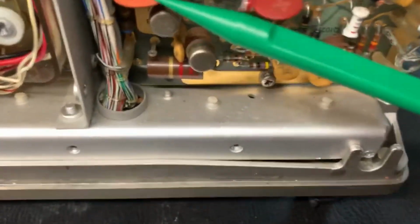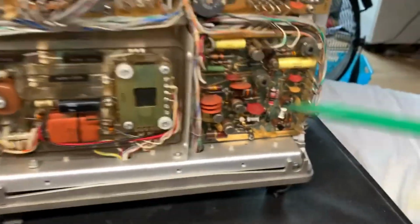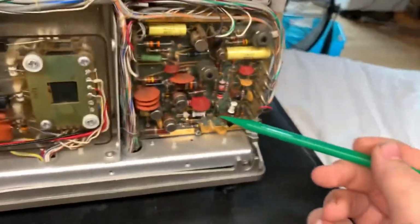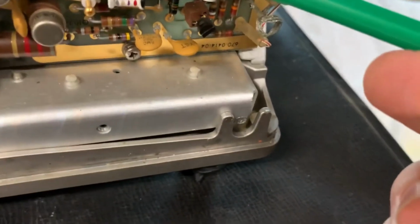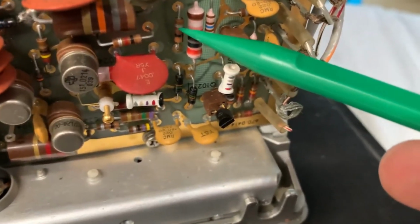You've got a bank of ceramic capacitors, it looks like. Yes. You've got 2 more transistors. These are, I think, Motorola ones, and I guess that these are the original. They might be, but they look out of place here. But they are Motorola. They've got gold-plated legs, and they seem like decent quality. So I shall just trust them. Tubular capacitors. Oh, that resistor seems like it has gotten really hot.